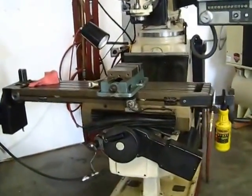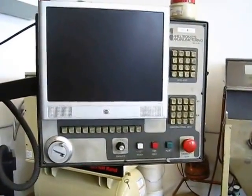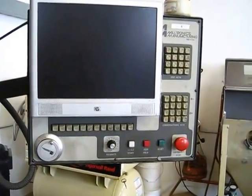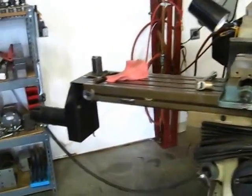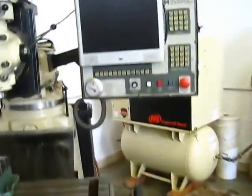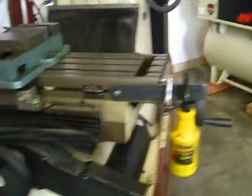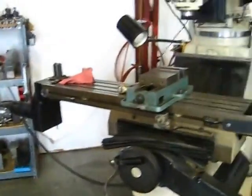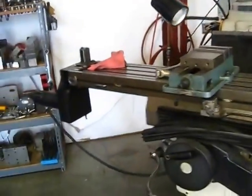And then you can come over here if you're doing it by hand, which means you crank these by hand while the bit is turning. You can see where you are in X, Y, and Z on this display. And once you understand what it is to do milling, and you want to go the automation route, you can load your G-code into this controller, and it will actually control all 3 axes, and you can automate the production of whatever kind of piece you're working on.